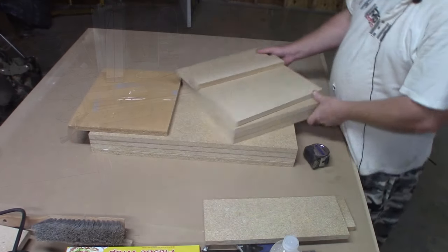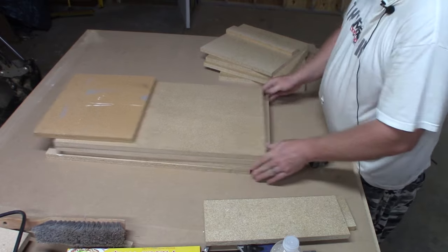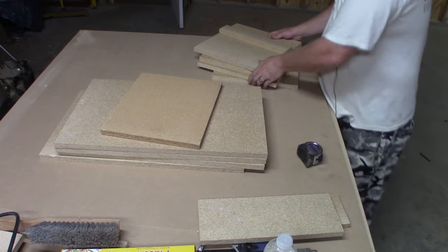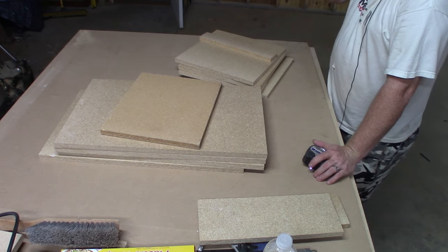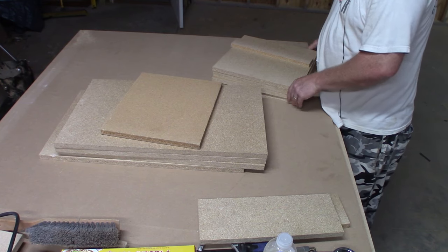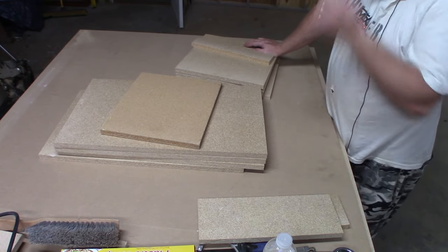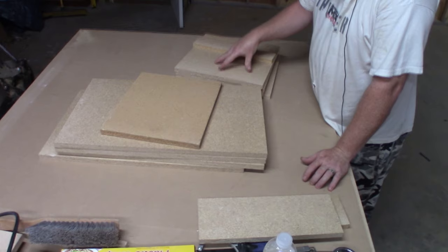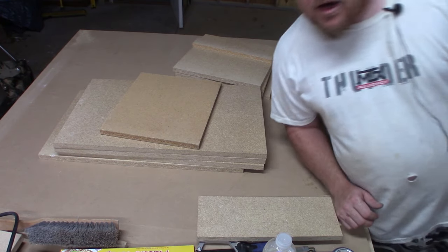The box is completely cut — four pieces here: front, back, top, bottom. I also use a scrap piece for the port, same type of wood. This is built out of three-quarter-inch particle board. You can use MDF, which is what I have below. My bracing structures are done on the CNC machine. Particle board is normally used for entry-level to medium-caliber subs, but if you do good bracing you can take it further — I've used this stuff in competition and won. It's not what you've got, it's how you use it.